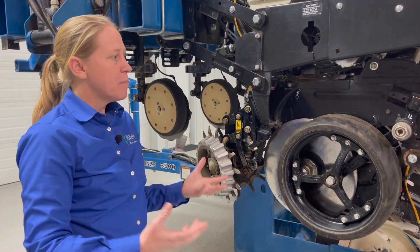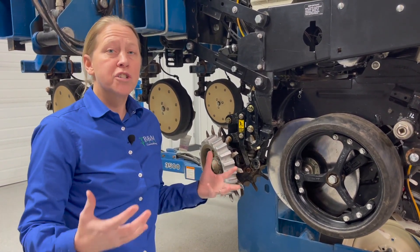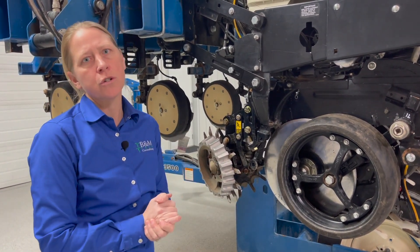This really depends on what type of soil conditions you're in, the type of tillage you're in, and what your overall seed bed condition is like — because remember, this planter will feel whatever is underneath it. So adequate down pressure is really critical.